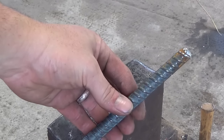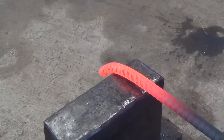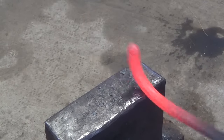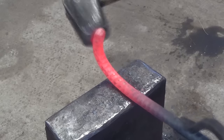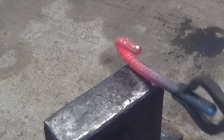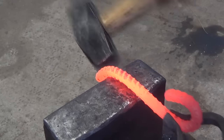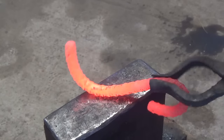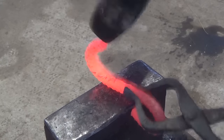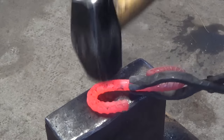Now we're going to make a hanging hook. I've taken one of the scrap pieces and rounded off the end so it doesn't catch on anything. Then I start forming my S hook — it's pretty similar to forming any of the other hooks and loops we've been doing. You just curl over a half circle in one direction, and once it looks nice and even, heat up the other end and make a half circle in the other direction. When you're forging the hooks you want to make sure that the ends aren't too closed so that you can slide them onto each other easily.